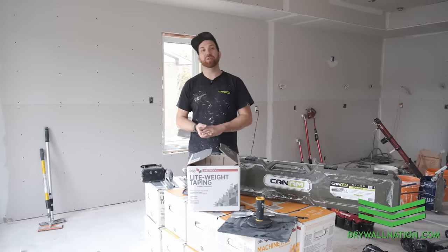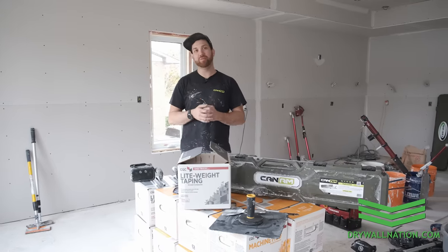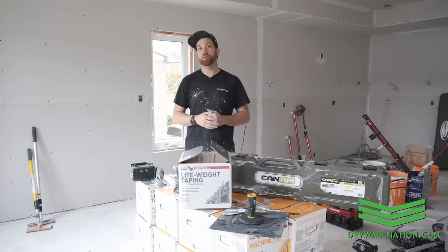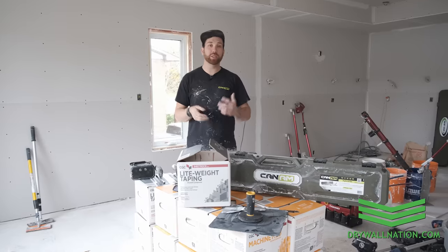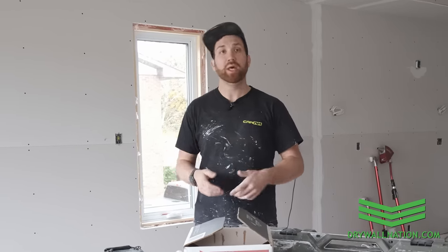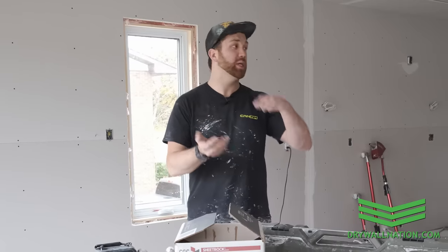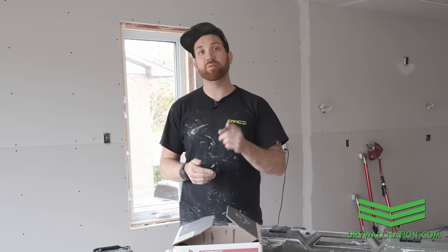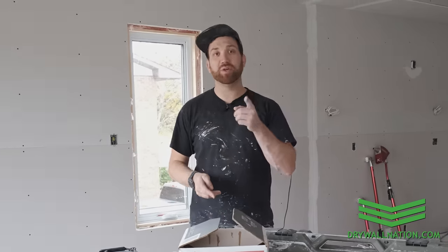I hope you enjoyed that video on the importance of pre-filling and v-grooving your butt joints. Let me know in the comments — is pre-filling something that you do on your jobs? We've been doing it for years and find it good practice, but I know a lot of drywall finishers don't pre-fill. Let me know where you're from, and whether you use setting compound or joint compound, and what you pre-fill — butt joints, seams, or just busted corners and big gaps. Would love to hear from you. Thanks for watching and have a good day.